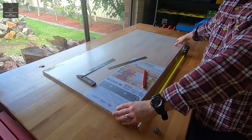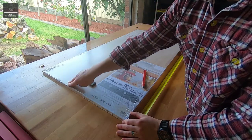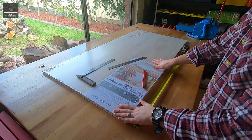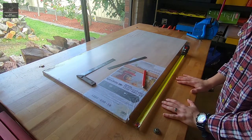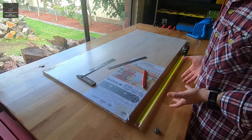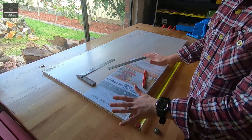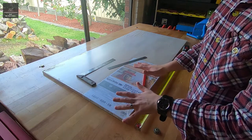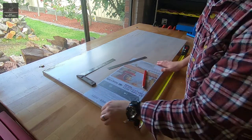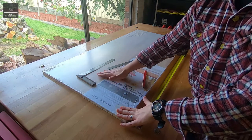With the excess timber, we're going to cut a strip and screw it into the underside along the width of this side here. That way when you're using the pasta board and you rest it on your kitchen bench top, that piece of timber will locate it and prevent the board from moving forwards as you're working on it. Pasta boards can have various forms, shapes, designs and uses in the kitchen. We're just going to keep it nice and simple with a square shape and a nice locating border, then sand and finish it off with a food safe wax.